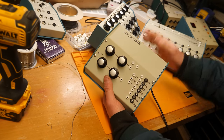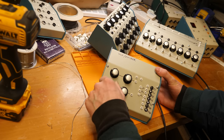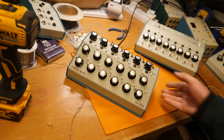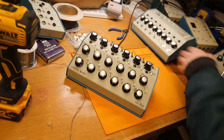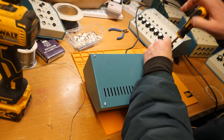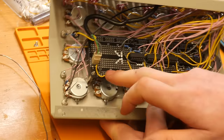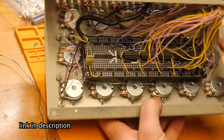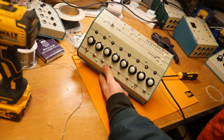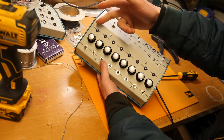The first real build is based on a Curtis chip — it's a VCO so we can get tuned output, for example by plugging into a Beat Step Pro. There's a pitch control, attenuation, PWM, and a clock divider based on a 4024 chip. The second build is this big mama — a hex oscillator. The idea is it adds slow LFOs and square wave modulations. It's based on the 40106 chip. Both of these are made on a hack modular breadboard-style stripboard layout. And the last one, which I put together just last night, is a sequencer based on a 4051 multiplexer chip — a weird sequencer that requires a binary number input rather than a clock, so it jumps around rather than stepping one through eight.